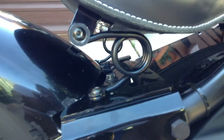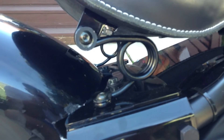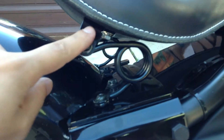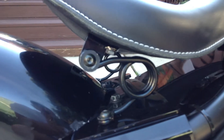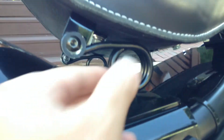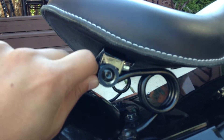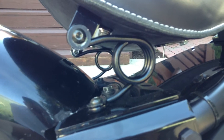He had these in his shop and suggested that I try them — they're a thicker metal, a stronger design. I brought them home and found out that both holes were the same exact design: this one was flat and this one was flat. Obviously I need the bottom flat and the top twisted in a vertical motion. I had to put these clamps in a vice, heat up this corner, and basically take this loop and twist it from horizontal to vertical. By sheer luck, both sides I did it in one shot each.